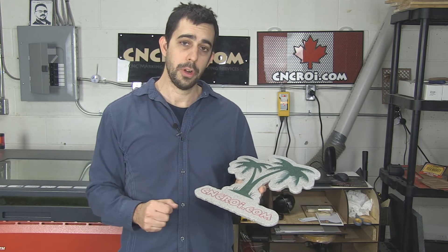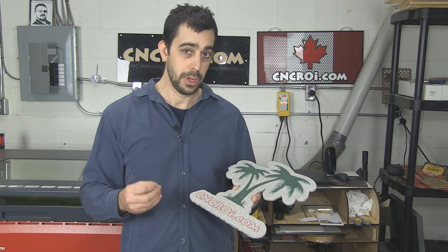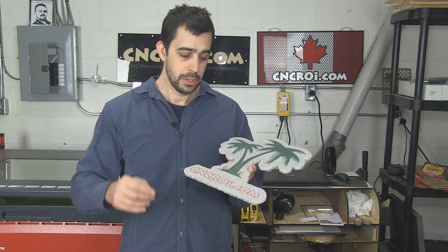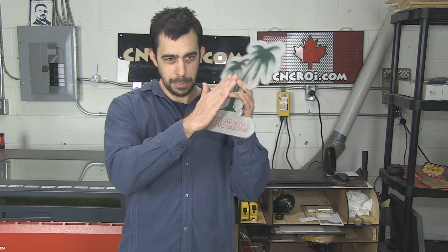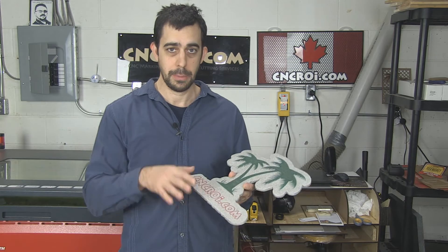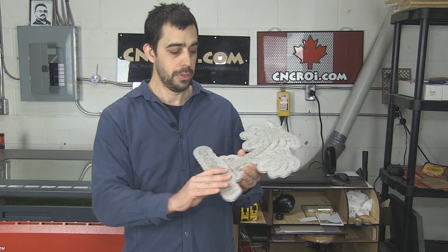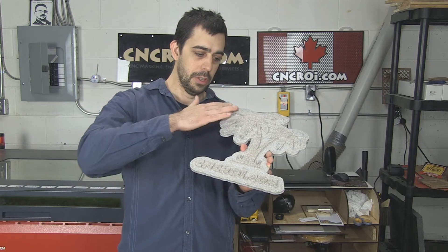I could do more, but what you do is actually start to show the material inconsistencies regarding the density of the Corian. I could go in maybe three or four millimeters, but then you end up with a bunch of little pyramids and stuff — that's just the different material compositions that make up Corian. While with the router, you don't have that issue; you're just going straight over it and removing the material, because you have that two-way feedback for the z-depth.